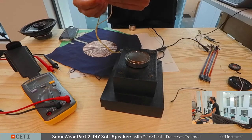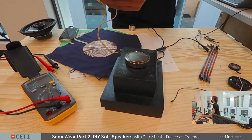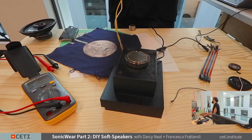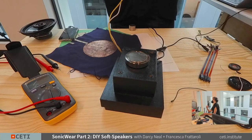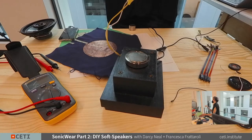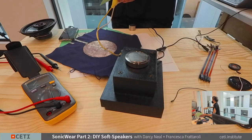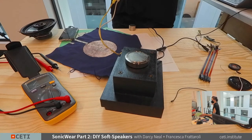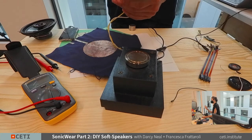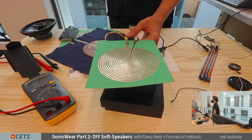When you are running a voltage through it, which in this case is your audio signal, any voltage running through a wire creates a magnetic field around it. If one side is positive, let's pretend the yellow is the positive in this case, the magnetic field is going to go in one direction, and if you reverse the voltage so that the positive is on the other end, then the magnetic field changes in terms of its north and south pole. An audio signal is going into the positive ranges, down into the negative ranges, back and forth so fast that it causes this to bounce back and forth at this crazy rapid speed, I think it's like 300 milliseconds per second or something. It's a lot. So that's actually what's happening: the voltage is bouncing back and forth, causing the magnetic polarity to change like crazy.